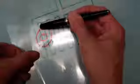Now when the pendulum with the slots slides into the magnetic field area, these eddy currents cannot flow because you have discontinuities, high resistance air gaps, so you're not going to get those eddy currents and the resulting large opposing magnetic field. The kinetic energy of this pendulum as it slides in is converted to heat in the aluminum due to the eddy currents.